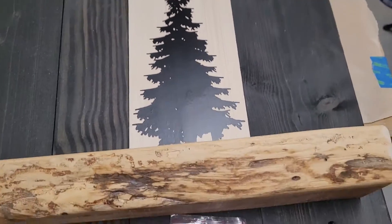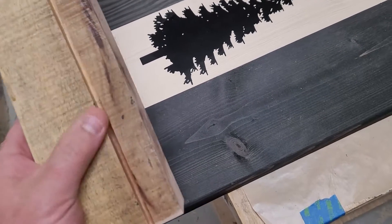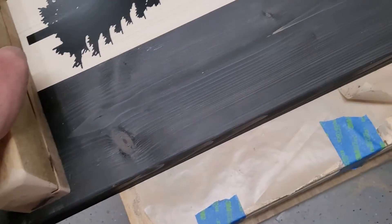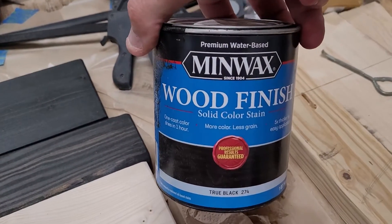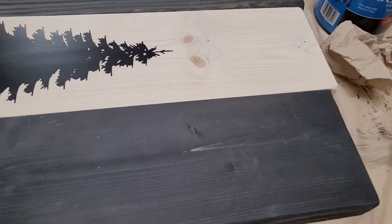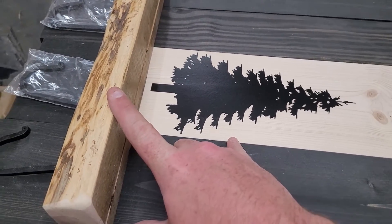The problem I'm having is the tonal difference. This does have spar urethane on it from when it was going to be a coin holder — it's a clear coat but it does have a little bit of a yellowing effect. And this is real pale, which I like the way it pops off of the black. By the way, that is Minwax Wood Finish Solid Color True Black — it's very thick, almost like paint. You put it on and then immediately wipe it off, and the grain just pops like crazy. So the color difference between these two isn't sitting right with me.